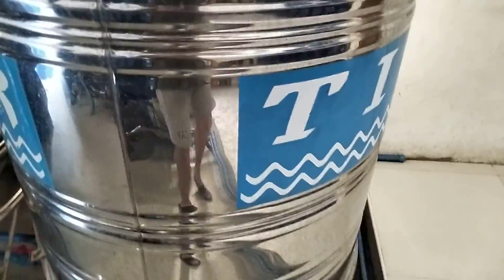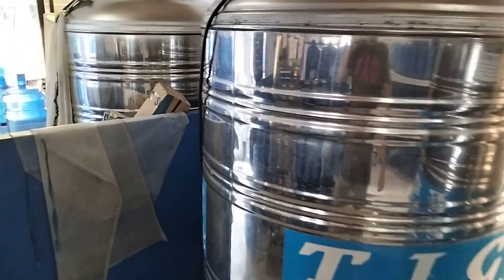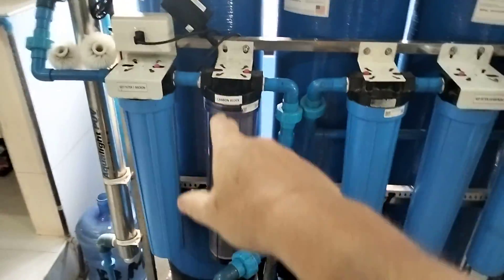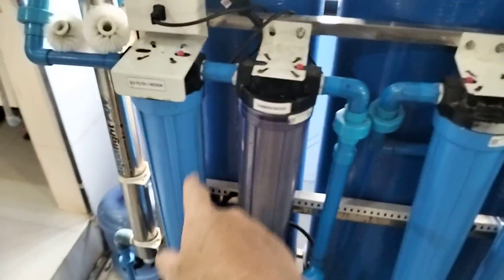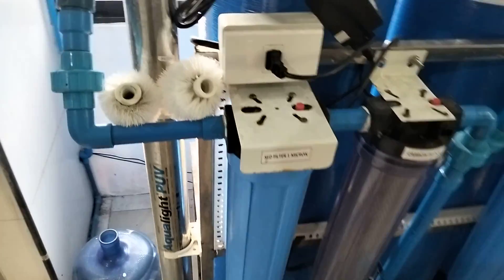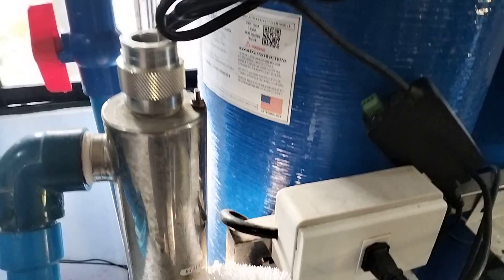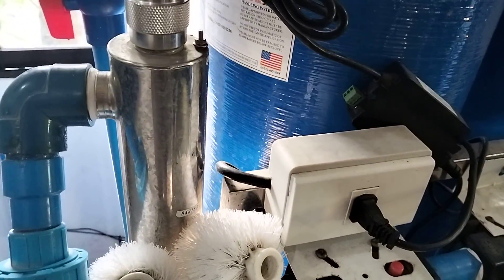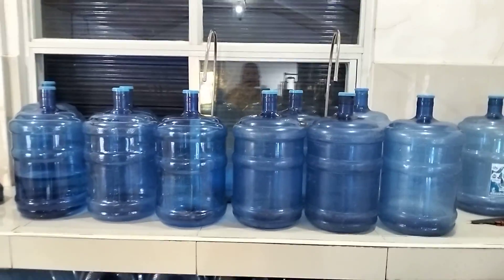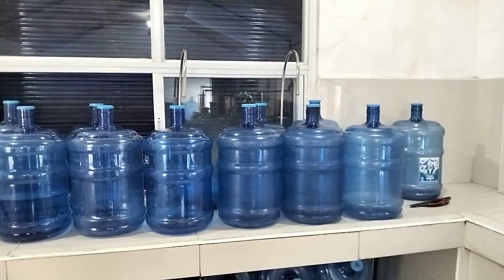After here, the water then goes into the storage tanks — the pure water tanks. We have three of them here, so at any one time we're holding around about 3,300 litres of pure water. Then from there, when the customer is at the window, we turn on the pump and it comes through the carbon filter here — last carbon treatment — then it goes through a one-micron filter. The very last stage is our UV lamp for bacteriology. Inside here is a big UV light tube, and that kills off the last of the dangerous bacteria, and then straight out of the faucets into the gallons, sealed up and ready to go.